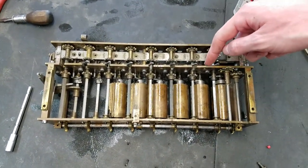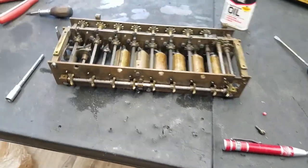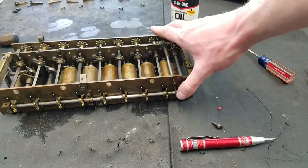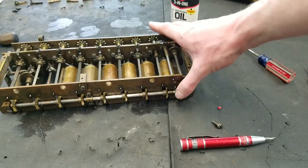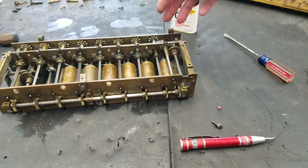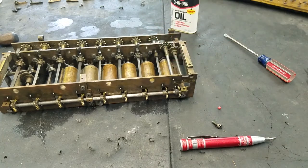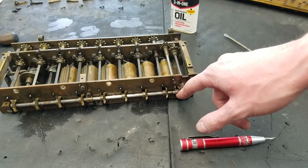I'm going to repeat that process on all the other ones to get the machine running smoothly. I also took off the carry trips piece to clean that up, and with that out you can kind of see the motion for that. These fingers would normally be right here, and when the carry pushes on this, it pushes on this — but they'll only engage at a certain point because there's a cam on the shaft that clears the carry trip.